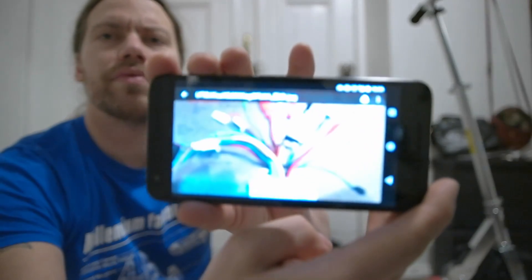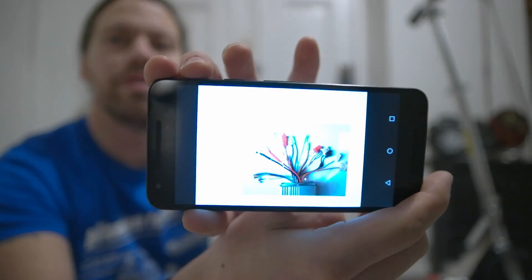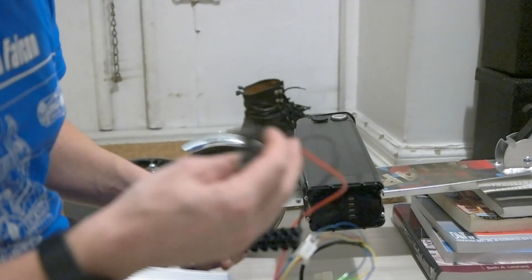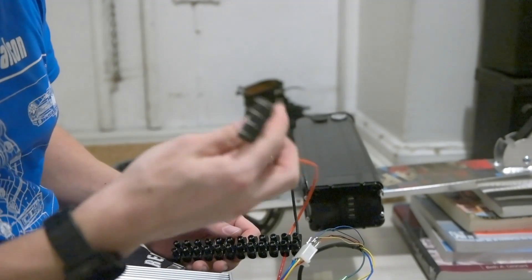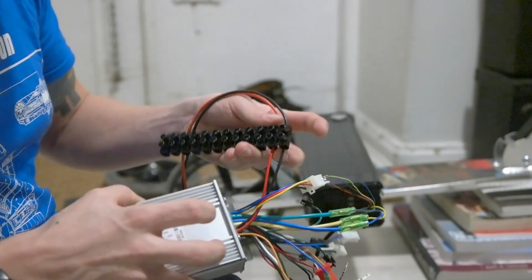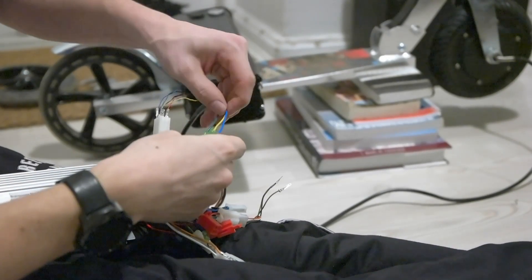I got some photos from the seller. Let's see — these are not that great. The wires are not all the same color; I think the pictures are from similar type of controllers but not the exact one I got. The first thing I did was connect the power plug that goes to the battery into the controller using this connector — that was simple. And also the three-phase connection to the motor.